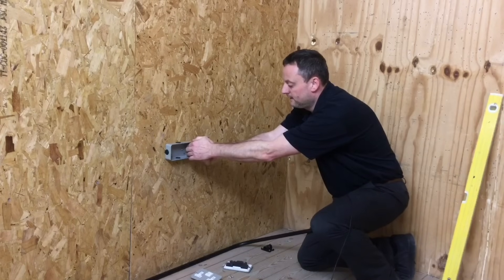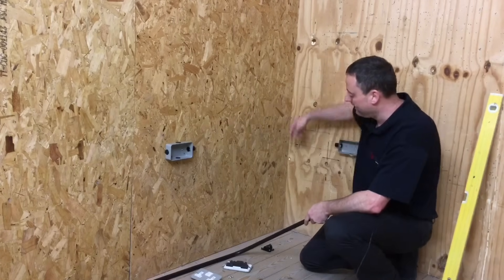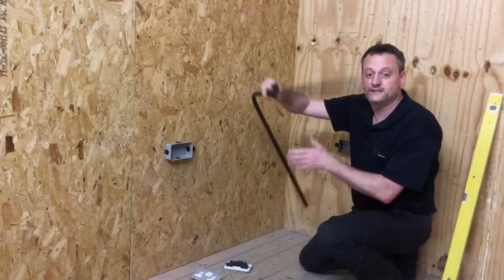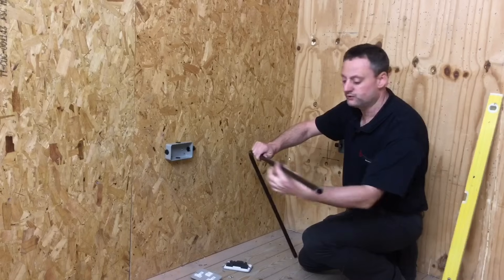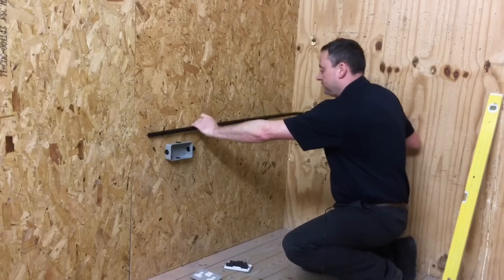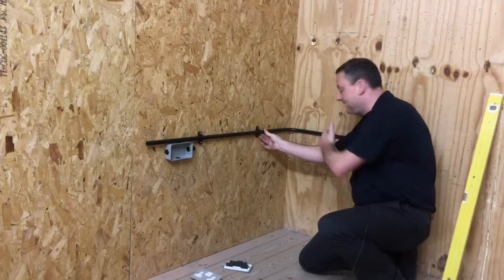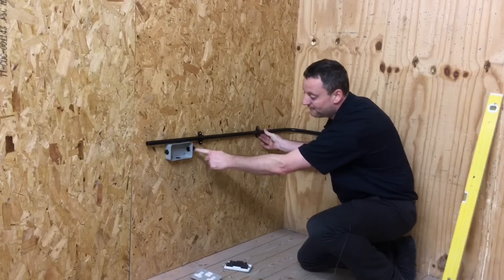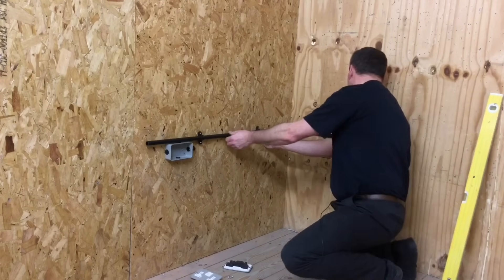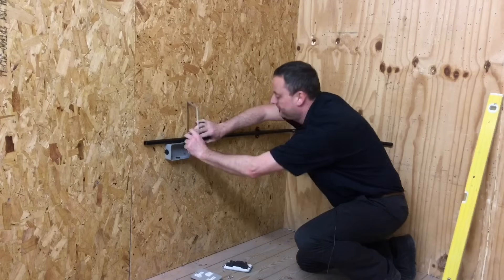The adapters are in. I slide some saddles on the back of the conduit section as a temporary cross-reference so I can get it running horizontal with the wall. I offer it over the top with a couple of temporary saddles on for length, then work out where to cut the pipe at each end — remembering the conduit won't go fully into the adapter, so both ends need to be accounted for.